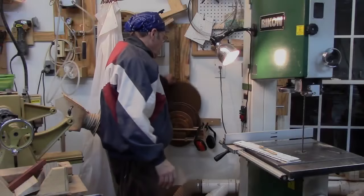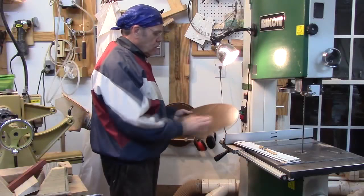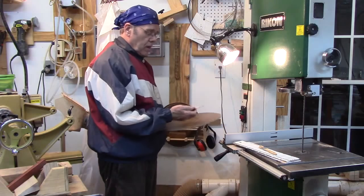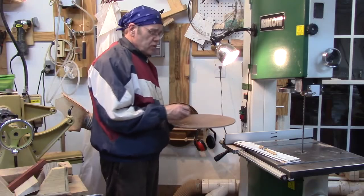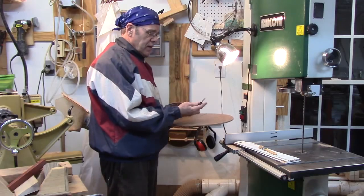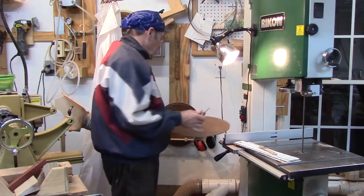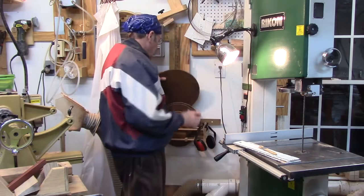Show you just a few of the templates that I use. I have a number of different paneling templates, different bowl heights. I made a small little awl that I stick in there. I've seen people hammer in nails and use screws. Let me tell you, a little awl is the simplest way to fasten this to a bowl blank, and that works. That tip I got from my buddy Wes Jones in my club, and that just works real good. And I just keep that handy right here where I can always find it.